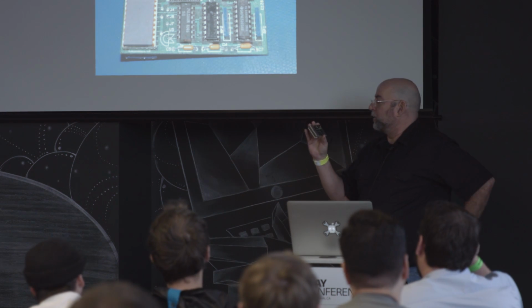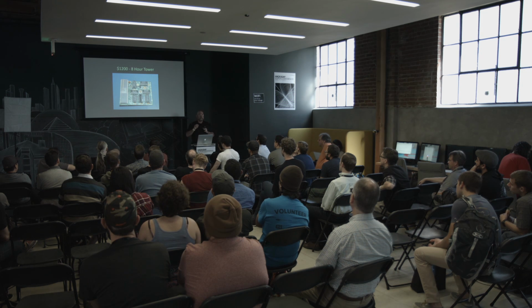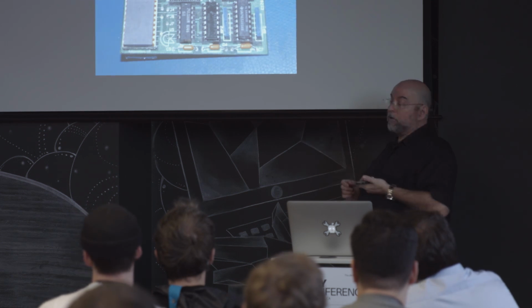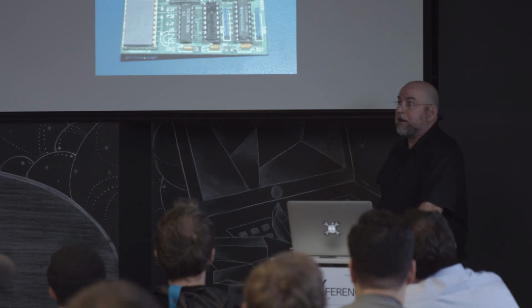So these things show up. What they are is good old phase lock loop circuitry, and I take the VIC clock and I make it into the 8563 clock, and this plugs in place of it. And then I left one wire off where I didn't wire it up, and I could move that wire to adjust it, like the dwell on your car. That's because I didn't know either, but I could find it, right? So going into CES, we pull one out of our ass.